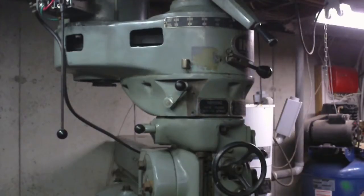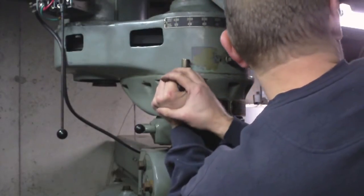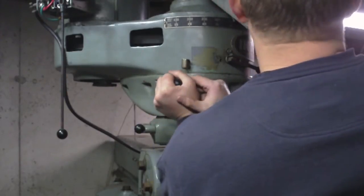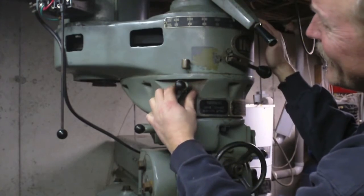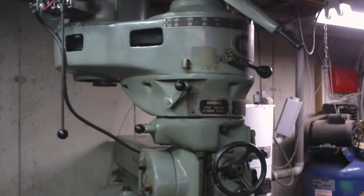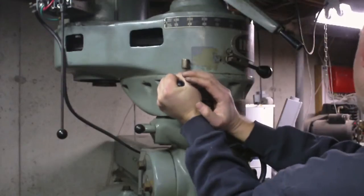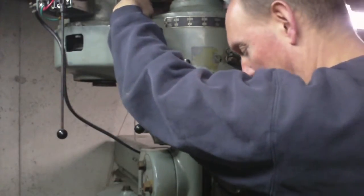I got the VFD at around 1.6 hertz, so I'm actually spinning this really slowly, seeing if that would help get this to come out. It's not doing anything for me. It's possible there's still some rust or corrosion that's causing part of the binding problem, but the thing was, this thing was working beautifully when I had this all out, so that's why I don't think that's it. Something else is going on here. It's really stuck. I'm gonna have to take this whole thing apart again.